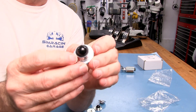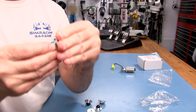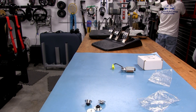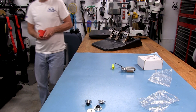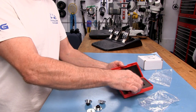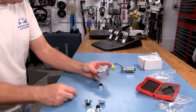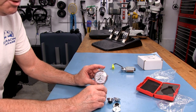There's a polyurethane tip on here. I'm going to measure the durometer — the shore rating. This is more of a preload kind of thing. It's pretty soft, actually — I'm looking at about 72 on one, and about 84 on another.